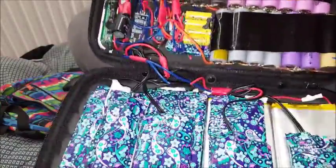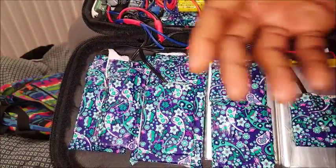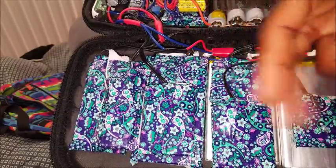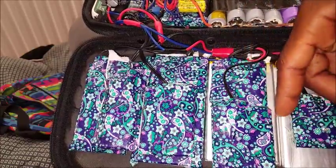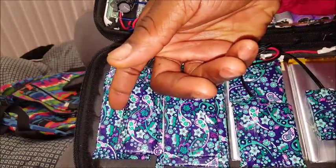On the bottom half, I'm trying to achieve 12 volts, so I need to run the batteries in series. To make the numbers easy: 12 divided by 4 is 3. Each battery is going to supply 3 volts, going into the next battery for 6 volts, then 9 volts, and the last 4th battery gives me my 12 volts.